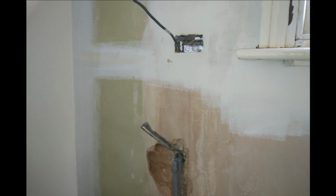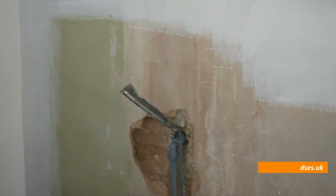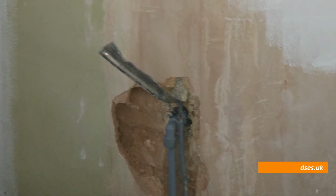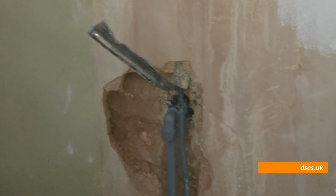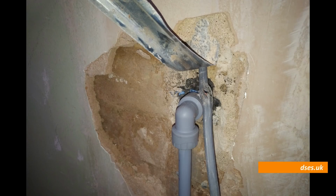You know, as an electrician, it's not uncommon to find oneself stiffed over by another trade from time to time. Take this recent example that I posted on Twitter, where post first fix, a plumber had turned up to site, drilled a hole for pipework from the outside without measuring and checking for our prescribed zone, and subsequently smashed through our capped cable and a big chunk of the plasterwork. Upon realising his mistake, he figured, well, the hole's there now, and proceeded to nick our prescribed zone for his pipework, leaving us with a repair and reroute task.